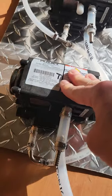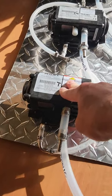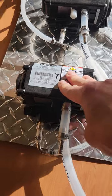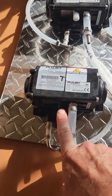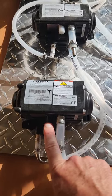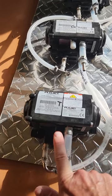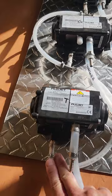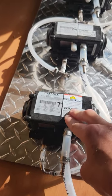Once that's done, we expect the pump to make some sort of noise or action. There is a possibility that the pump itself has jammed or malfunctioned in transit — it was tested before we sent it, but unfortunately with secondhand pumps, things do happen. Usually when these pumps blow, you get gas constantly whistling out of the exhaust port. When the pump is working, you'll hear a 'tss tss' noise and a bit of gas will come out. If the pump dies, nine times out of ten you'll just hear a constant hiss, and if you don't take the gas connection out it'll empty a gas bottle within a couple of hours.